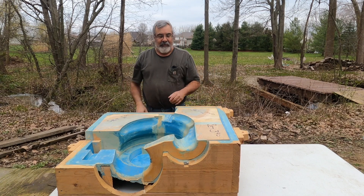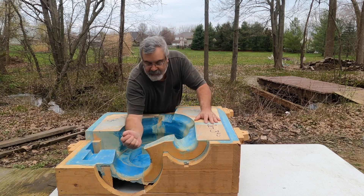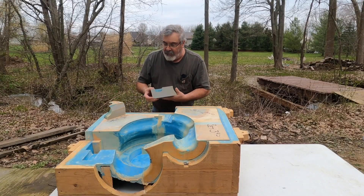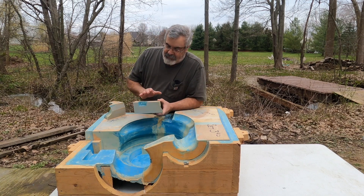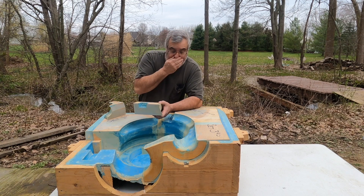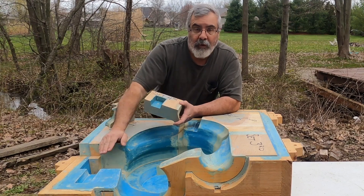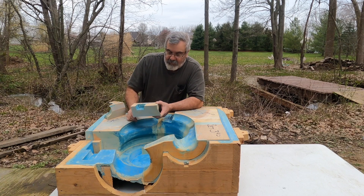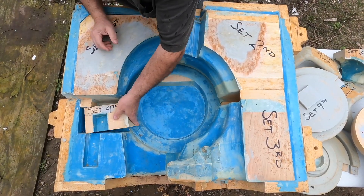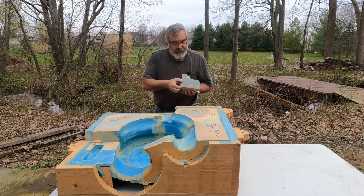Like I said, these things aren't going to fit in perfectly because this is old — I got into business in '07, I probably did this around '08. So there's that third one. Here's number four and five. This one I could see real easy. There's a whole big core print for this, and like I said, sometimes there are core prints within the core prints. You can see this part right here — part is in the core and part is in the mold. That's where it gets tricky: cores that have to be set into cores. It's really fun to measure those things.